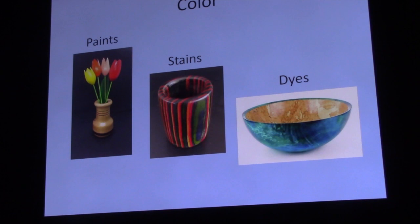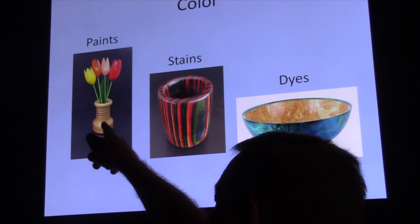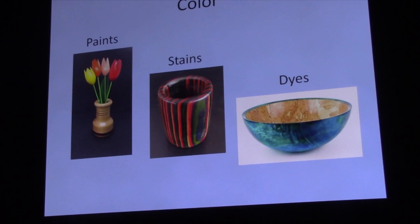She had to fix it. Well, I ended up taking the vase, I don't have it here, it's in North Carolina. I had it on the lathe, and I took my skew, and that's done with the Wagner tool. You can't see it, but that's done with the Wagner tool. I took my skew below there and cut it away, and took it above there, and then used other tools to finish it, and left that band proud sticking out beyond the base. Then I was able to finish that natural because I'd used just a regular stain that you get from Lowe's. It wasn't a penetrating stain, so I was able to clean it up. But if I hadn't had that mistake, I'd never have found out how to do that. Again, it was just trial and error in the workshop.